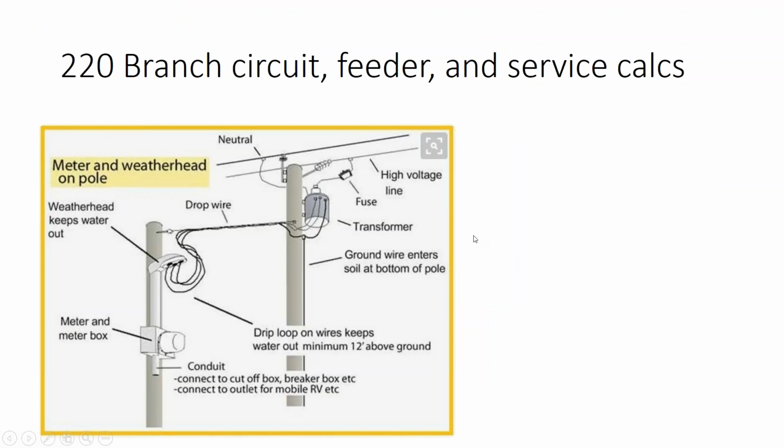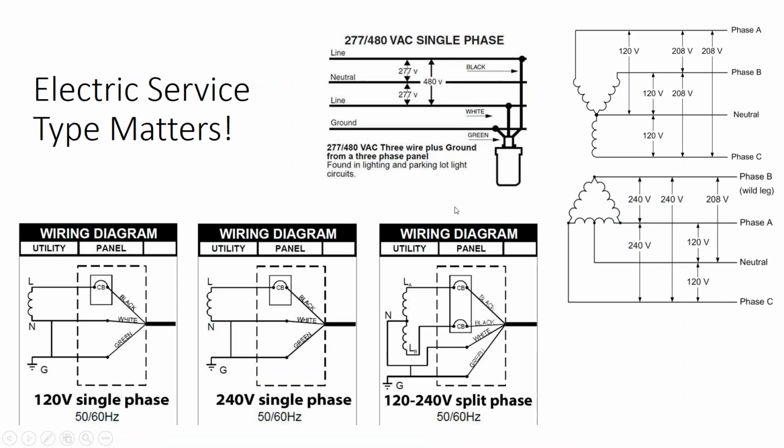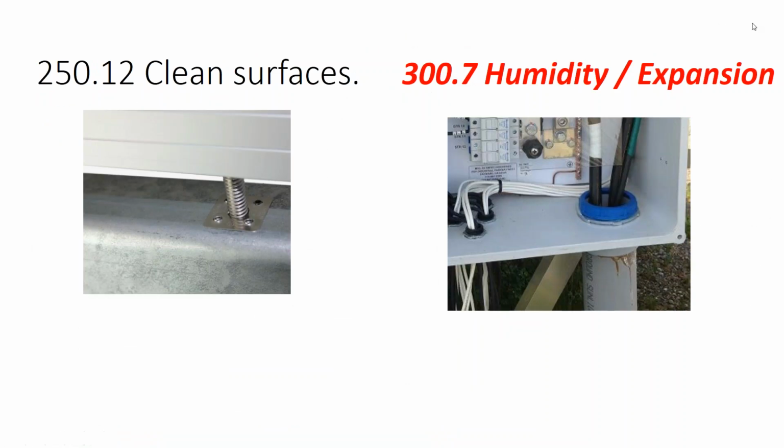And with this, we're kind of at the end of our time. Since we cover a lot of this stuff in the National Electric Code class, I'll just tell you that the number one error that I see seasoned installers making is wherever your conduit is going from underground up into a box, or from the attic up to the rooftop, you have to put sealant inside the conduit to make that relatively airtight.